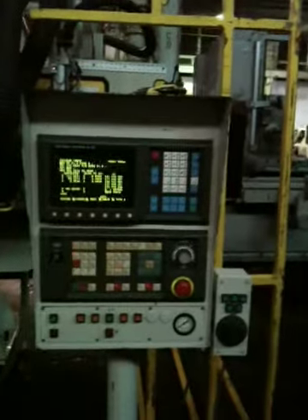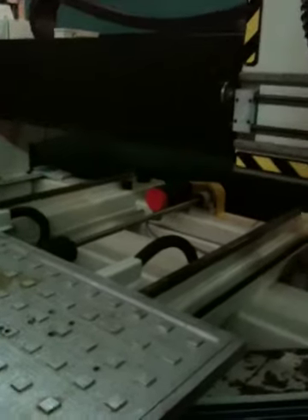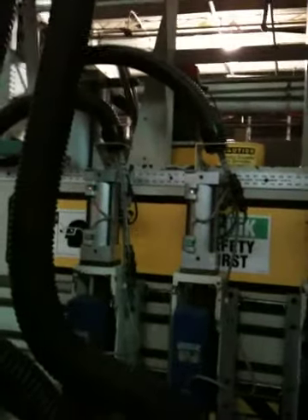It's got a GE Fanuc OM Control. You've got a pulse generator there. Here are your four spindles. That's a Fanuc AC motor, and that's a ball screw. That's another Fanuc AC motor up there for your vertical axes. And we have one other way back behind — we'll show you that later. But first let's have Mike give us a little demonstration of the machine.